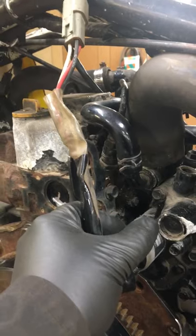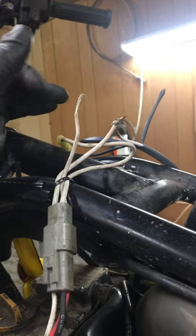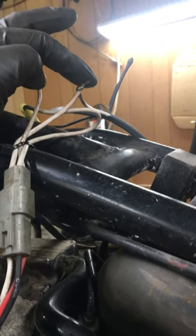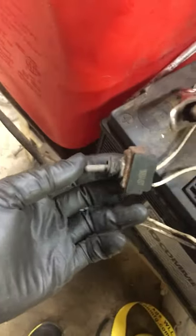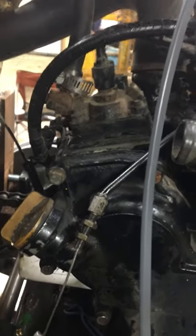The fuel shutoff switch, or solenoid, is located right here. I thought I knew the wiring for it, hooked it up, and it started to smoke a little bit, so I had to do some experimenting. I don't have the third wire hooked up — I'm not really sure what it is. Online I found that one wire is a pull-in and one is a pull-out, although when I disengage the pull-in it springs out, so I'm not even sure I need it. The other wire is going to ground. I have the power wires tied into the same wire running my fuel pump, hooked to a switch — pump kicks on, and you can hear that click: that's the fuel shutoff engaging and disengaging.